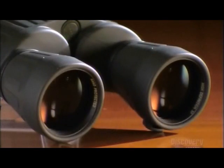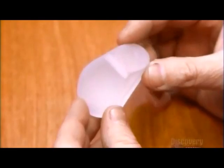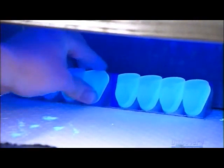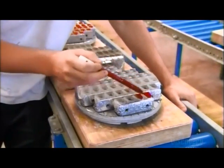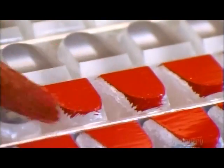The objectives are curved, causing the image to appear upside down. To turn it right side up, each binocular half needs a glass prism. Using UV light-activated glue, workers mount several prisms on steel plates that take them through a series of grinding and polishing steps.